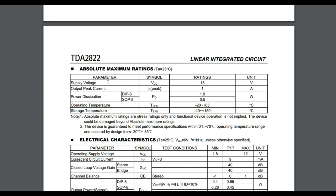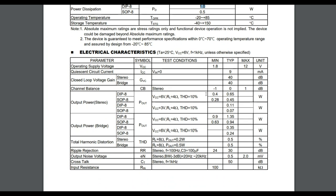Looking at the parameters and actual characteristics: no more than 15 volts — not going to be a problem, we're probably going to run this at nine volts. Peak current one amp, we're talking maybe 100-200 milliamps tops. Power dissipation max one watt — we're not going to get close to that. Quiescent current nine milliamps.